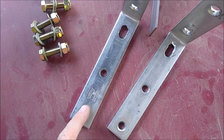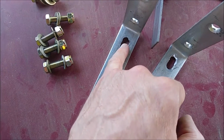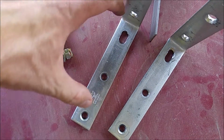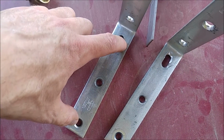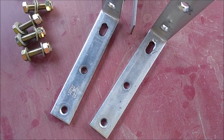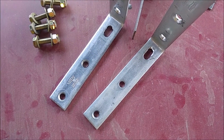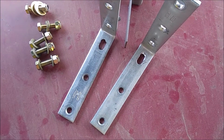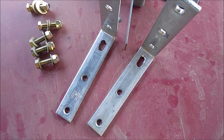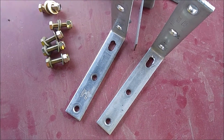And the reason is this is actually what's going to go on the tailgate. You'll have your tailgate bolt going to go here, but it doesn't quite match up with the 3rd hole. The tailgate on the JK, at least my JK, is a little bit wider. So you just notch it out there, and that way you can still stick your bolt through it. I'm going to use the original tailgate bolts that came on the JK right now. They're 8.8 metric, which is about a grade 5 for US. But I'm going to probably upgrade that to, I think it's 10.9 in metric later to make it a little bit stronger. But as far as having enough thread, there is enough thread on the stock bolts for it to work.